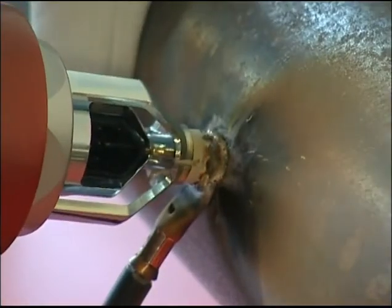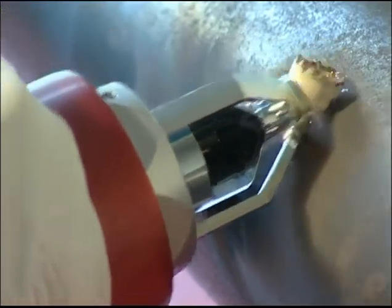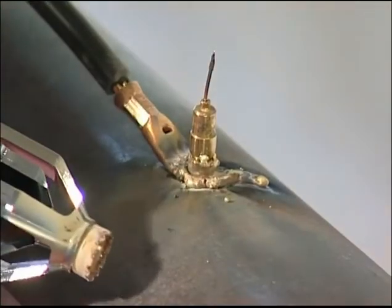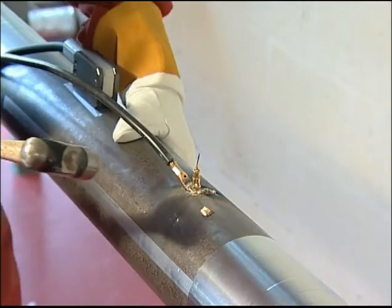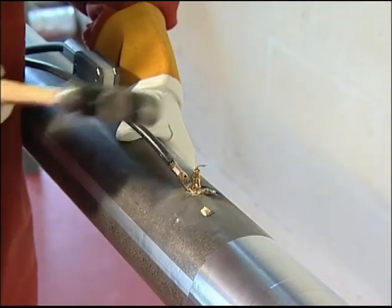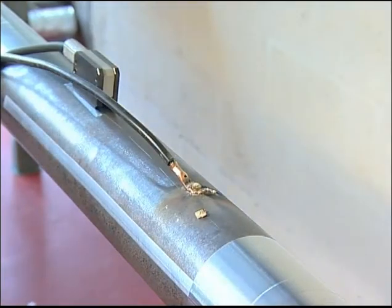Remove the ferrule from the gun by prising it against a hard surface or with pliers. Try not to bang the ferrule out of the gun. Discard the ferrule and remove it from your immediate working area, as it will be very hot. Take a 1.5 pound hammer and knock the remaining shank from the pin or tap the unthreaded base of the threaded pin to test the connection.